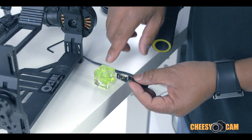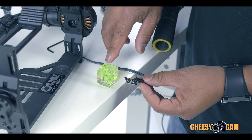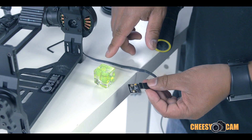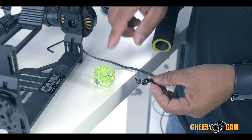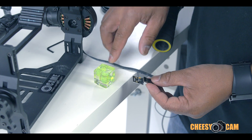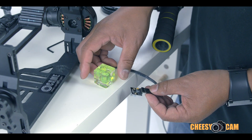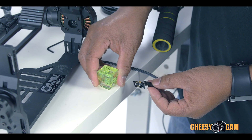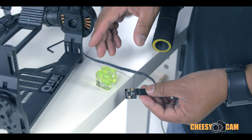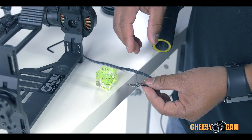I'm using a cube level. The reason is you may think your table is level, but it could be inaccurate — my level shows I'm slightly off alignment with my table, so this table is probably warped. What I do is physically hold the cube slightly upward just to get the bubbles balanced in the middle before hitting calibration in the software.